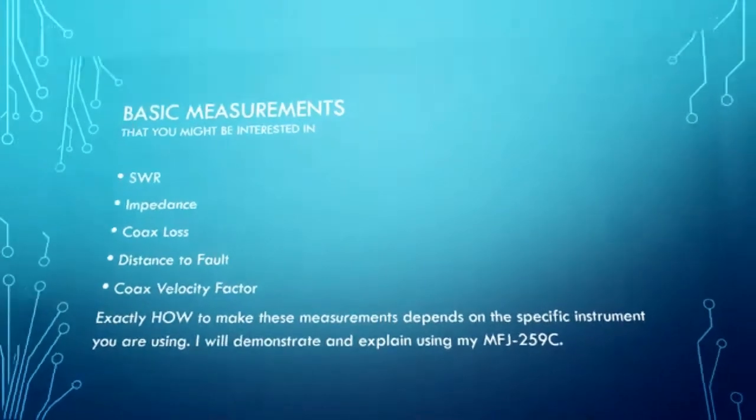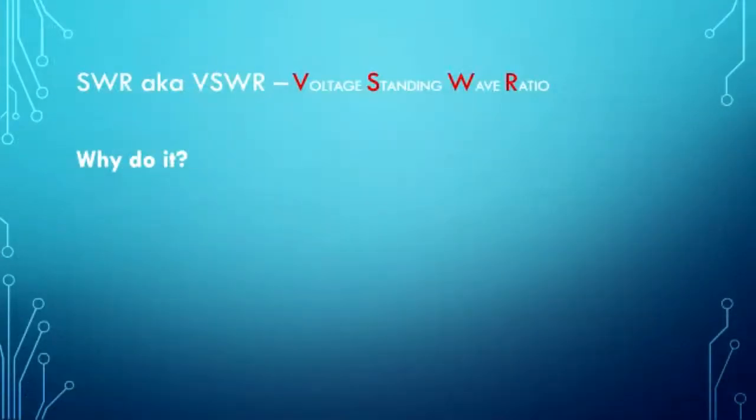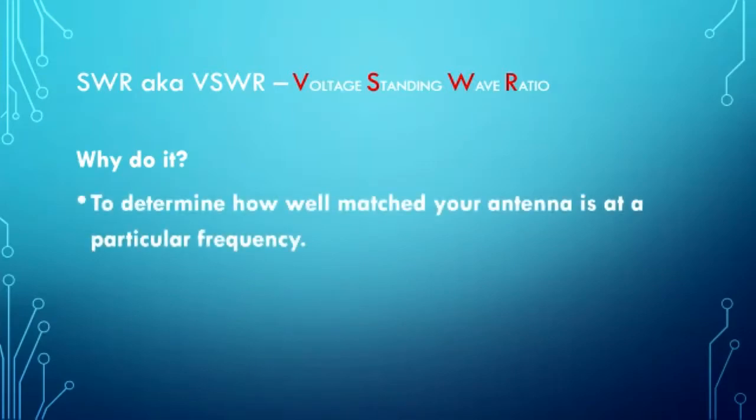All right. So, SWR, also known as voltage standing wave ratio. Why on earth do we do it? Well, to begin with, we do it to tell how well matched your antenna is on a particular frequency. If your antenna isn't matched well, you're going to be expending all kinds of power as heat and not actually using it to talk to anybody.